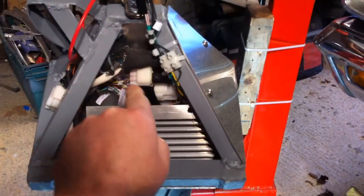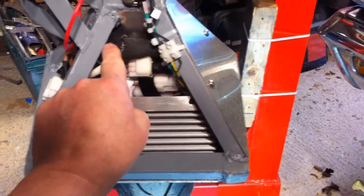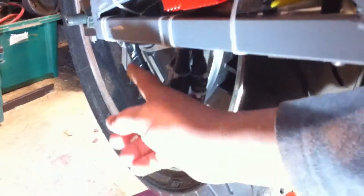The thing I've been doing next is really the packaging of wiring. You can see the cable which comes out of the axle has been carefully routed so the metalwork doesn't chafe it — round here, up here, into the triangular section at the back where the Kelly controller is. The fat cable comes over here, the thinner branches come out which are the hall sensor connectors. The thick three wires go down this side and are joined here to the wires which come out of the end of the Kelly controller.